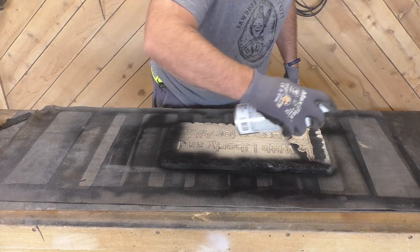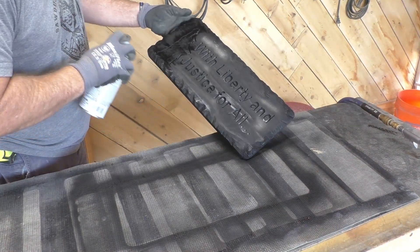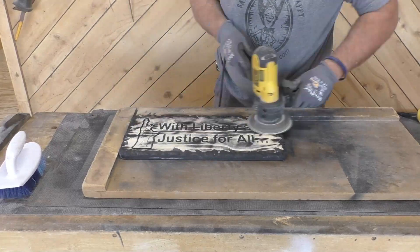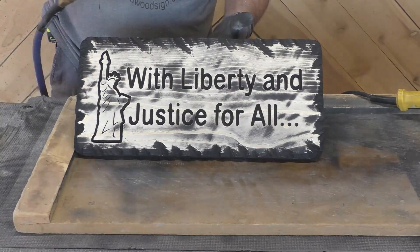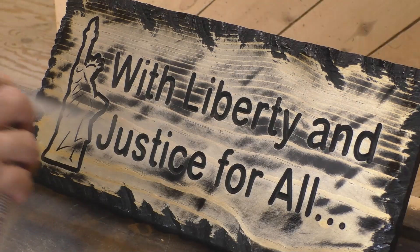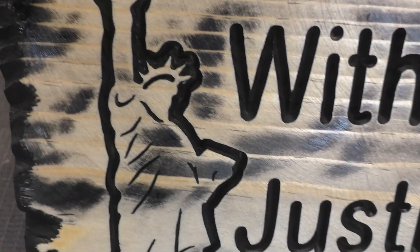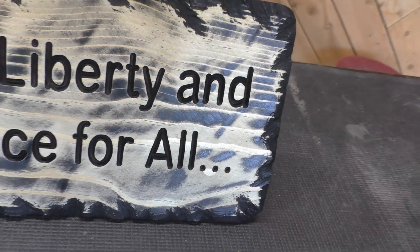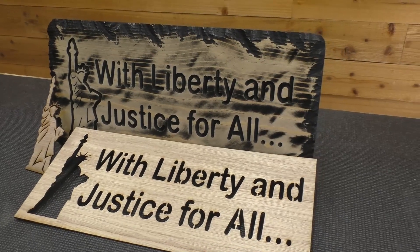Because we're going to leave a lot of the spray on this sign, dad actually sprayed the entire sign because we wanted a weathered rustic look. But if you plan on sanding everything off except your carving, you don't need to spray the whole thing — you want to take it nice and light. Once that was done, dad used the 80 grit disc on the disc sander and got maybe 50 or 60% of the black off. Then he used that same fine sanding sponge to give it a smooth finish. Then we put our spray on it, and I love the way this thing looks — and actually, believe it or not, dad does too.